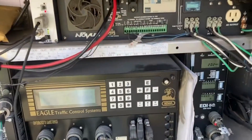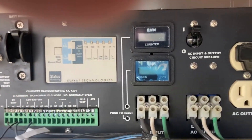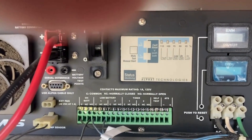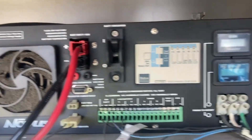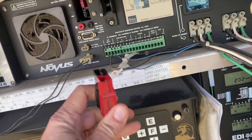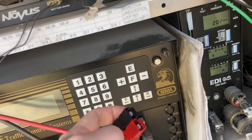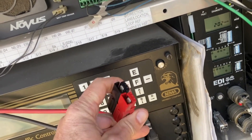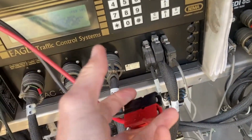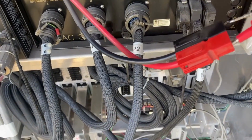Well, this isn't a great start. I don't see any activity on this battery backup unit — it appears to be completely dead. Going to plug in the batteries here; this is the input to the battery backup unit from the batteries. We've got four batteries in series, which would make up about a 48-volt input.